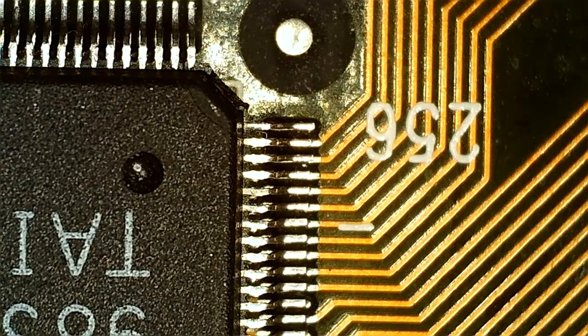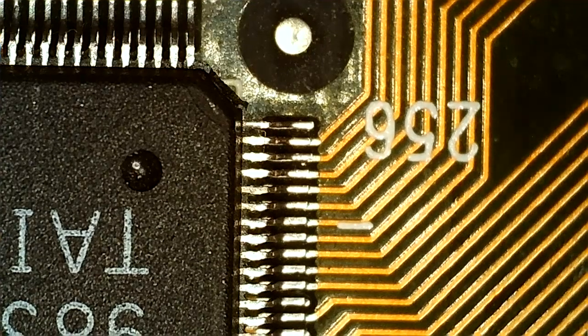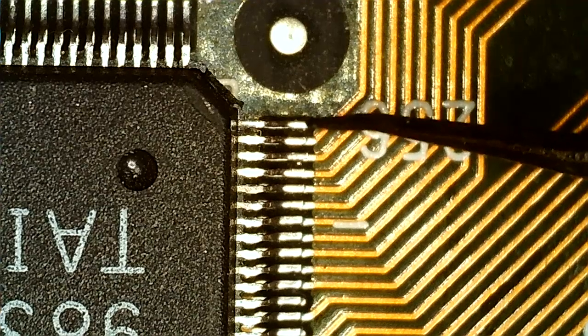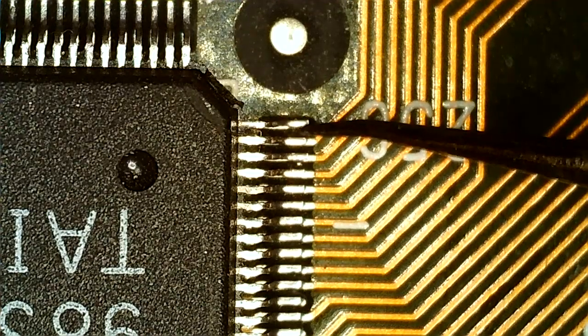So I did try the card and the computer didn't post, so I put in the post card and I got error code 13, which is AMI BIOS PCI bus mastering initializing. So basically doing PCI stuff. So I poked around here because I kind of expect stuff like that. So I found this corner here is a loose pin.